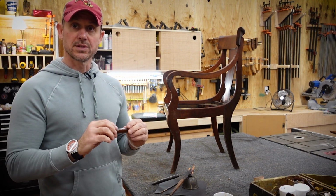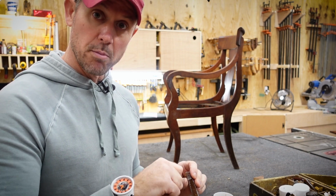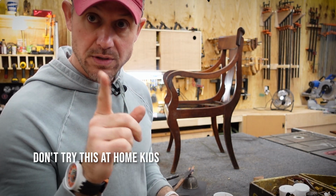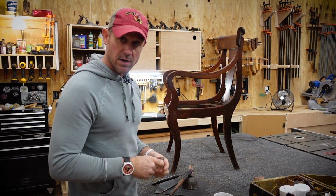The lacquer resin will stick to about any surface. However, if you get the surface slightly wet, it will pull off and it won't stick to it. So typically, I know it's a little gross, but we'll use a little finger spit. You put it across the surface here and that will take off the excess.